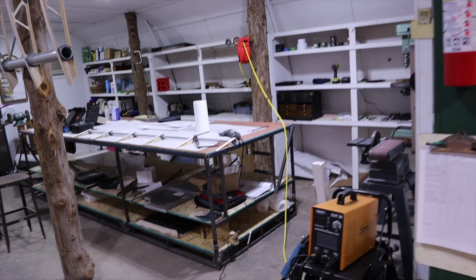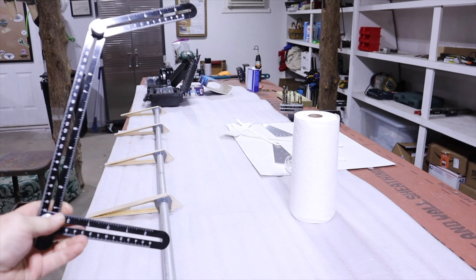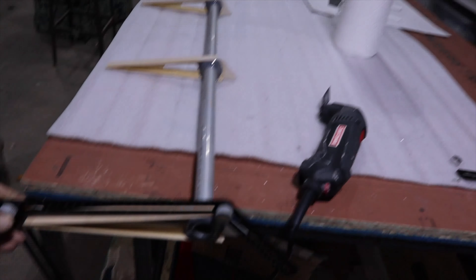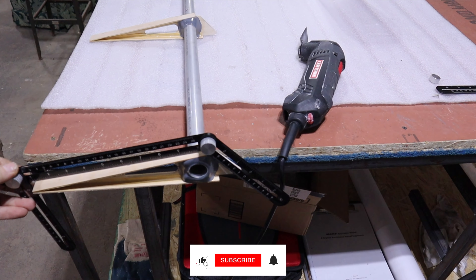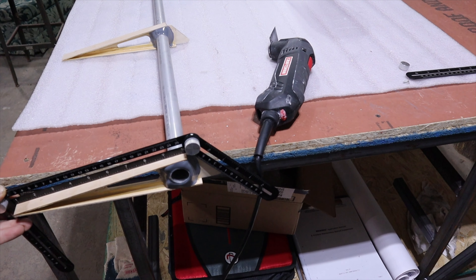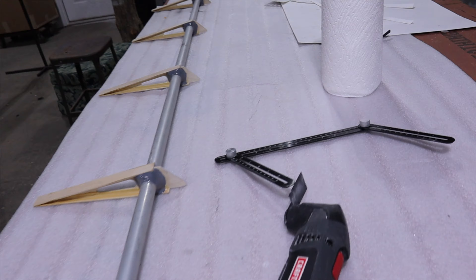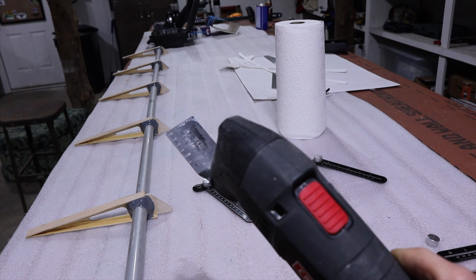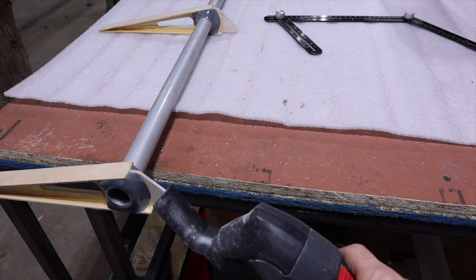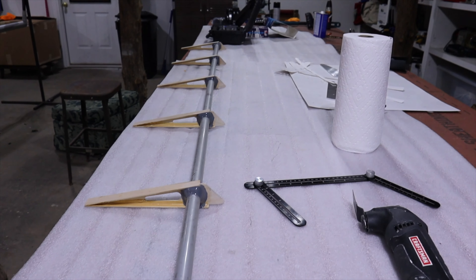Also did Steve Henry's leading edge mod. One thing that worked out really well — if you're doing the mod and happen to have one of these tools, it was extremely easy to just lay everything out. Basically set this up, lock it in place where it fits right on the back of the aileron, and it just has that angle locked into it. You mark all of them and you're good to go. This tool worked fantastic for cutting them — it went through them like butter. You just leave yourself a little bit of room outside the line, then sand back to the line, and they all came out perfectly.